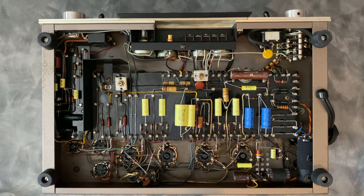And as you were turning it off, it didn't cleanly snap into the on and off position. There was like an arcing and crackling that happened in between the switch. And I didn't really catch it until I was doing listening tests, because at the bench, I usually have these connected to a current limited supply, and I'm switching it on and off with an external switch. So during the listening tests, I caught that one.